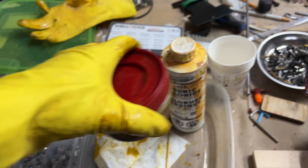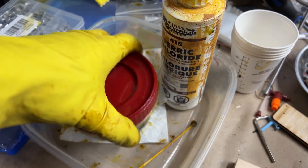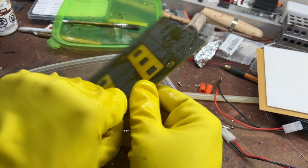Once you've cut everything up, the next stage is to throw this into ferric chloride. Ferric chloride is an acid — be careful, wear eye protection, wear gloves. Do not get this on your skin, in your eyes, in your mouth, or in your nose — it's bad stuff. Make sure you're in a ventilated area. Once you've done that, throw the board into the ferric chloride and agitate it. I just use a disposable ziplock container with some ferric chloride. The best way to check if you've etched properly is to hold the board up to a bright light — light will come through the etched areas, and the unetched areas will be opaque.